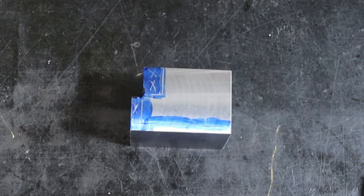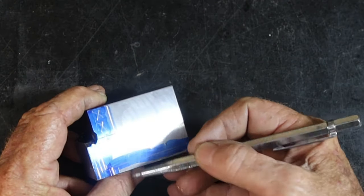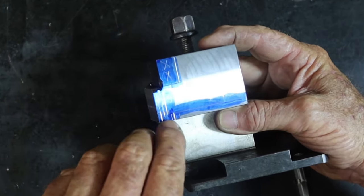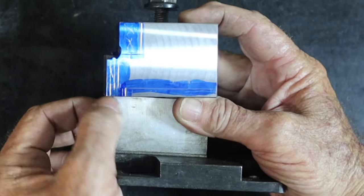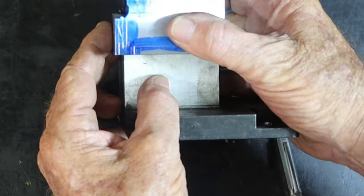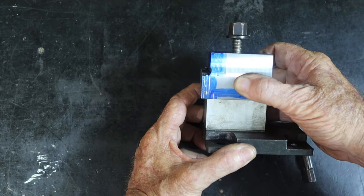That bit there has to be cut out five millimeters deep, and it'll drop down so that theoretically when I sit this on here it'll pull over to that edge. I'm a little worried about the strength in here, so the way I see it I have two options: I either mill a piece out of here that can sit down into it, or I leave it hanging out over the edge and make up a plate that bolts on so that it carries the base of it. There's going to be a lot of force being pushed down on the bottom of that, so we'll get into this some more tomorrow.